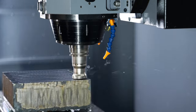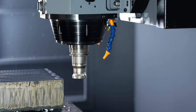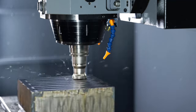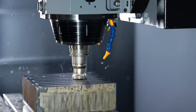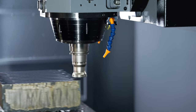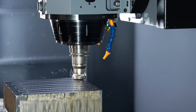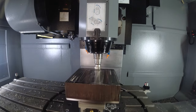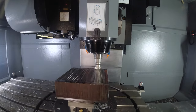Okay, so 21,600 — that's about 80 cubic centimeters a minute metal removal rate. That's starting to make people money, that's what it's about. We're still bouncing under 100 percent but it's comfortable. We've run this before, haven't we.